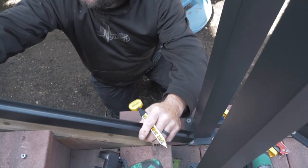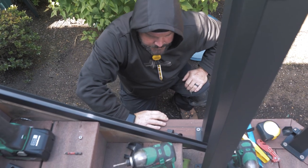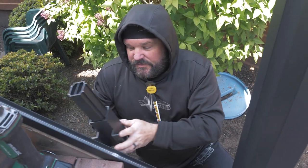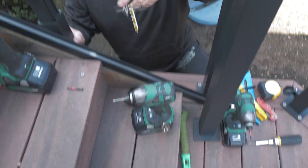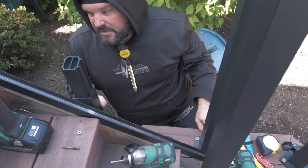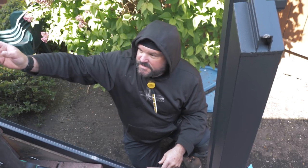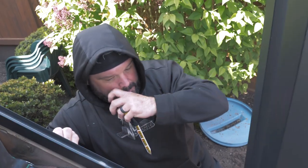I have to figure out the top and bottom rails for my two mounted posts that are already in, then come up with an intermediate post. For the staircase we have to do a fascia mount — it's going to get mounted to the staircase. So I'm going to take the base off of this one post and slide it onto this, and then this becomes a fascia mount post instead of a surface mount post. Right now I'm just trying to get my bracket set for the side so I can figure out the top and the bottom, and then figure out where the middle goes from there. We should only need one center side post for this run because it's a little over 12 feet, so we'll have about a six-and-a-half-foot run of railing in between posts.